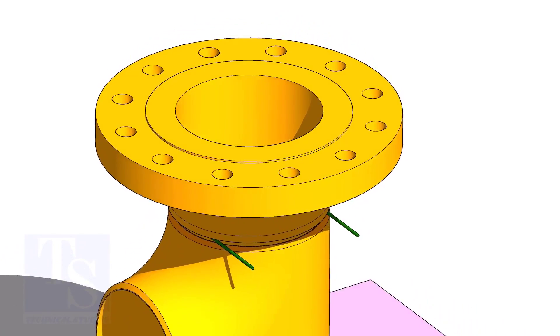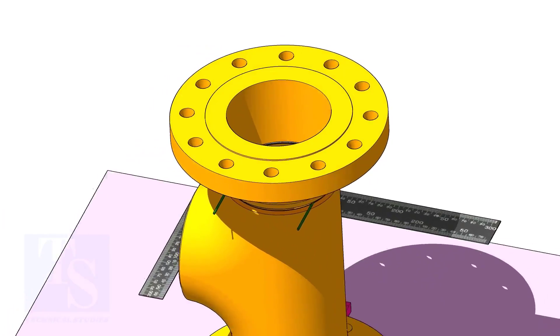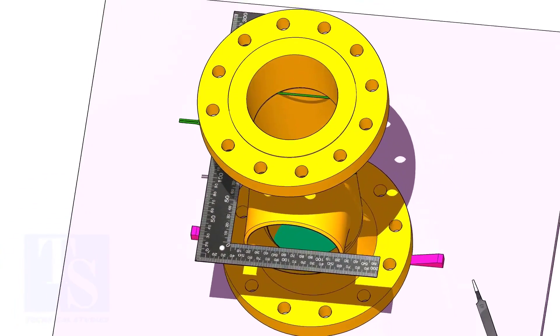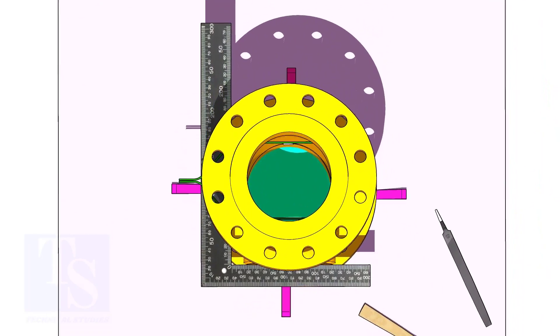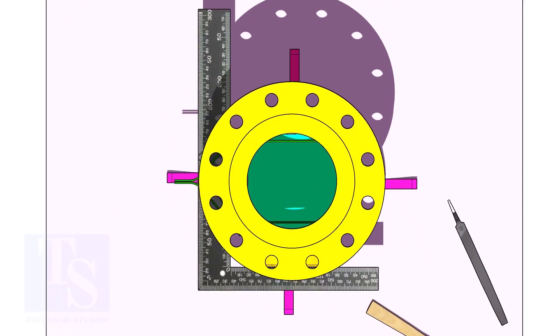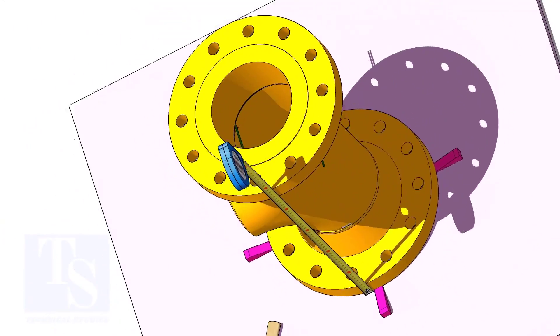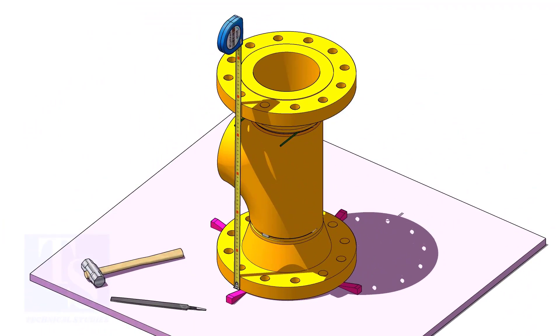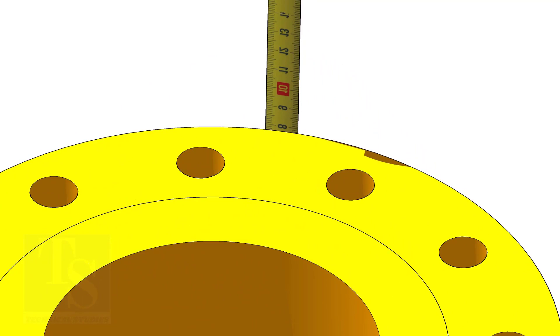Put the flange on the top side of the tee. Correct the hole center of the flange and the face of the tee, as shown. Correct the overlap. Check the height on opposite sides. If correct, tack weld on both sides.